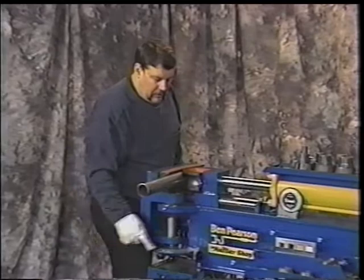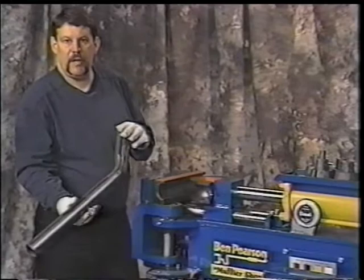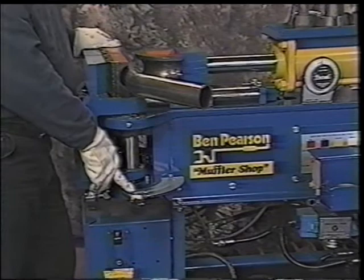It'll reach the micro switch, and it'll stop. It'll automatically retract. Anytime you want to stop it, just jog the machine. You note it makes a nice, clean 40-degree bend. If you want to manually operate this machine and put 40 degrees in, that's simple to do as well. Just pull your indicator back to zero on the inner, which is the blue scale, and now you're manually making your bend.